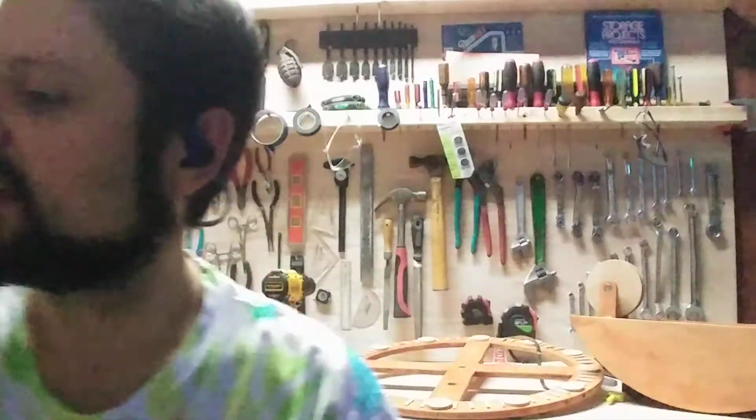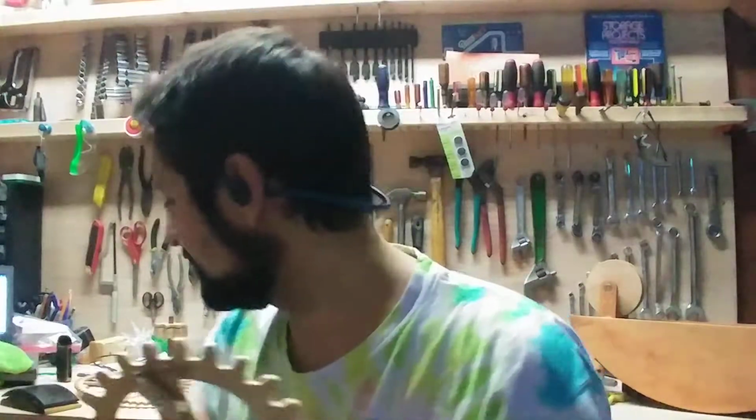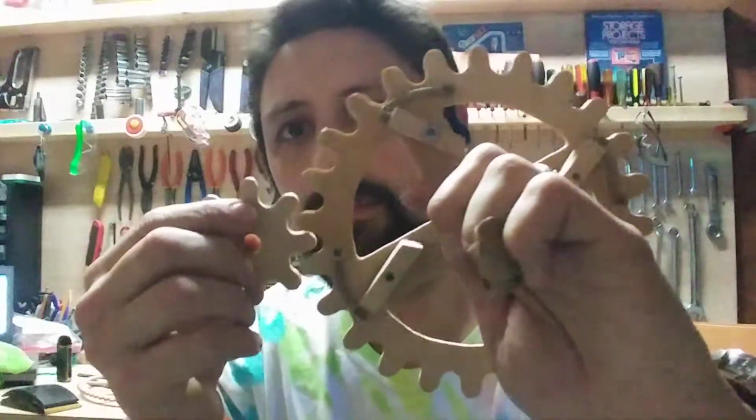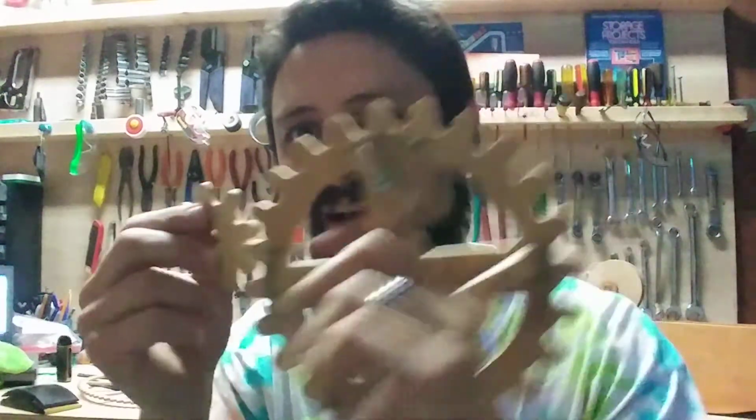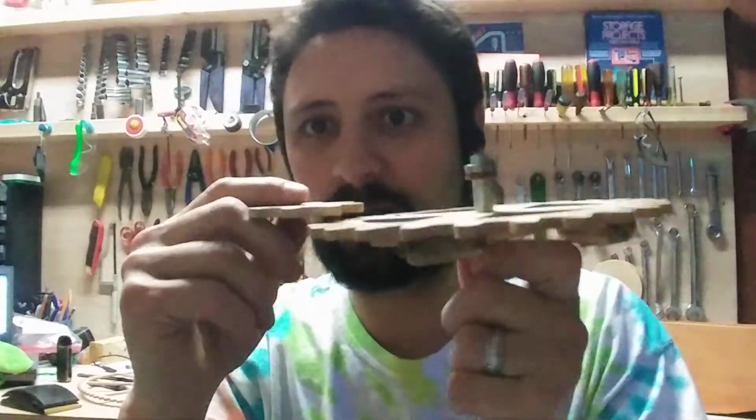And yesterday I sat down to do something online, and I heard this crash, explosions of pennies. And I had let my clock go too long without maintenance, and what had happened was the motor gear shaft became disengaged from its motor pinion shaft. So these two are supposed to mesh, but if one of the axles slides in or out a little bit and they don't mesh, all that weight on the motor goes woo, and 20 pounds of pennies comes crashing to the floor.